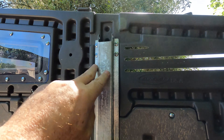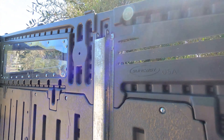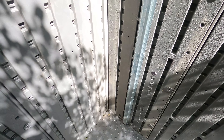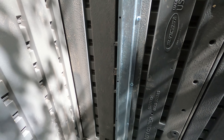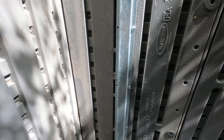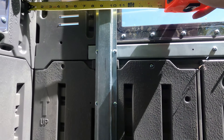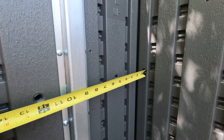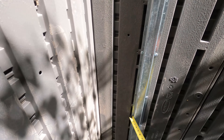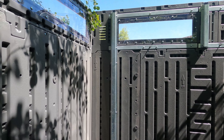If you have all four of these screws lined up right here, then the rest of the screw holes should line up. There weren't any screw holes at this spot though, so you'll have to just drill it in. As long as you get those four lined up on the top, everything else should line up. I wasn't sure if I made a mistake because there was nothing to screw these holes into, and I saw other holes nearby. I measured and got eight and a half inches here, and eight and a half inches on the top, to make sure it lines up with the back piece so the trusses will connect.